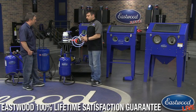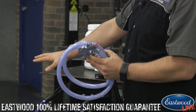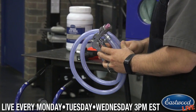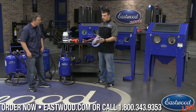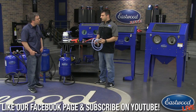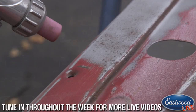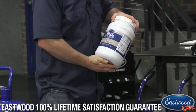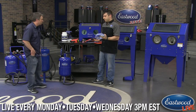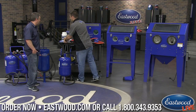Now for some handheld units — the blast-out-of-the-bucket. The idea is to give you a professional blasting gun without needing to buy a pressure blaster or cabinet. Whether you want to try blasting for the first time or just have small parts, you take a standard five-gallon drywall bucket, fill it with media, shove the pickup tube in, plug in the air, and go. Five to seven CFM works, but getting up to nine CFM is recommended. Eastwood also offers small containers sized to fit the tube directly.